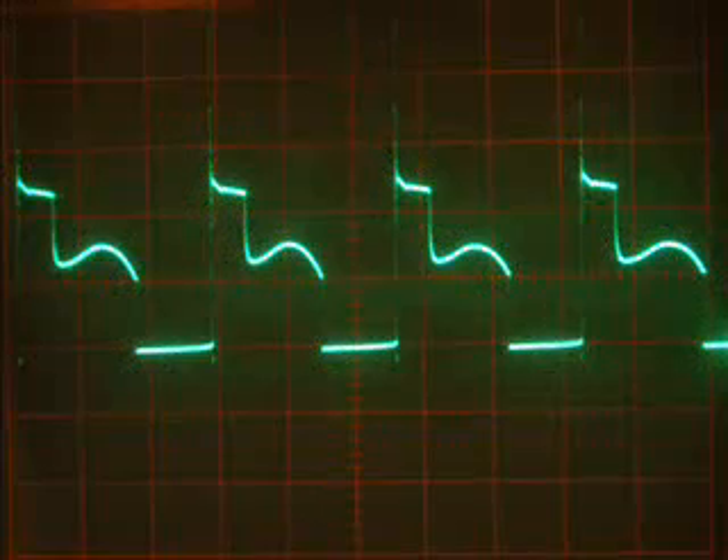This is a high resolution still of the H waveform. The zero volt line is marked, and TDC — top dead center — is the point when the rotor magnet is directly above the stator core of the coil. As the magnet approaches, voltage is induced up to TDC. After TDC the voltage inverts, which is enough to switch the transistor on.